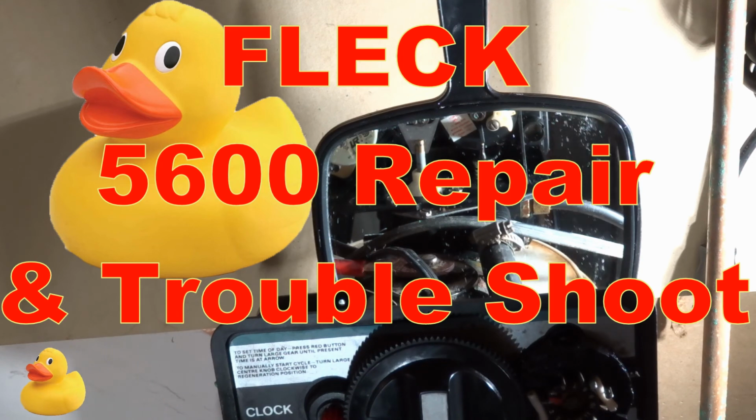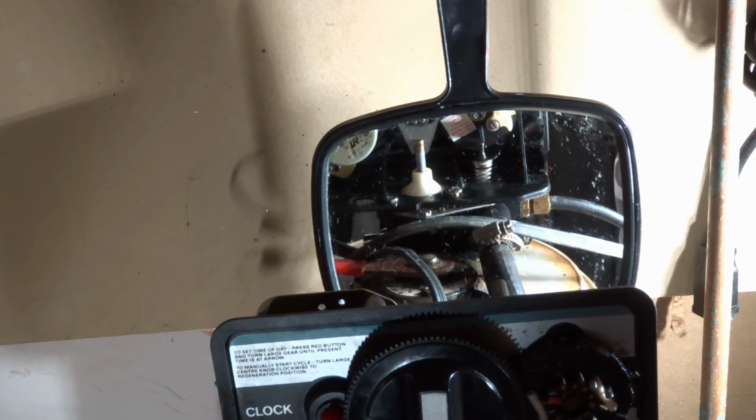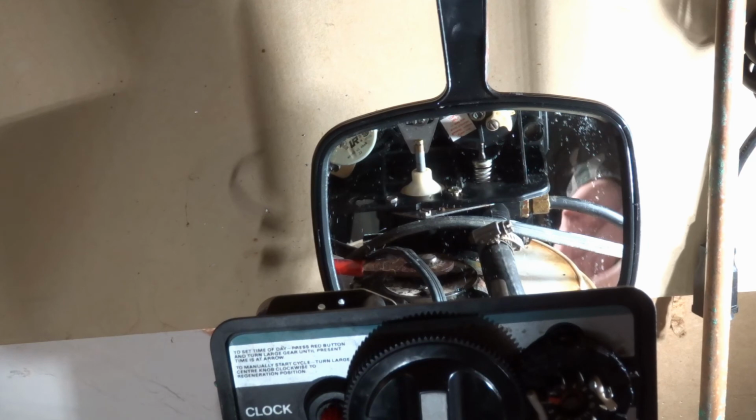But I'm going to take a practical approach, what any homeowner should be able to do if it's a manual thing like this. So unplug it first. There's a couple simple things you can check just to get started. This is actually an iron removal machine, same top as a water softener. So my brine tank is a potassium permanganate tank, but we'll just call it a brine tank for now. Same thing. So what's happening is it's actually overflowing, and that could be a float issue in the tank, but we're going to start easy here.